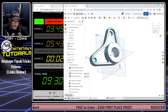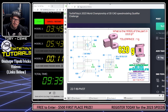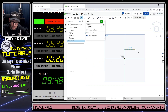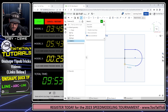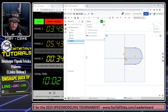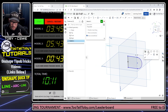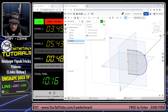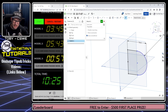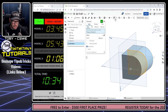Let's create one final model — I'll make a new parts studio. For this final model, we already talked about the game plan, so let's jump right in. I'll go to the top plane, begin a sketch, orient our view, create a line that comes across and a line that goes the other way, touch the endpoint, come around with a tangent arc, and close that off. Making this line horizontal, ensuring these two are tangent, making the midpoints coincident. I'll set the radius to 40 and the distance from here to the top of that radius at 80.